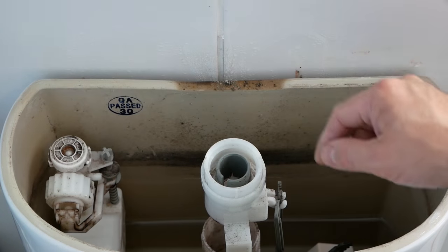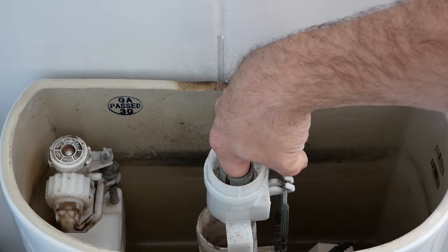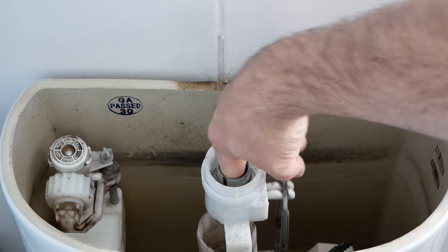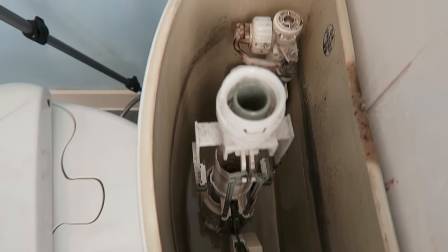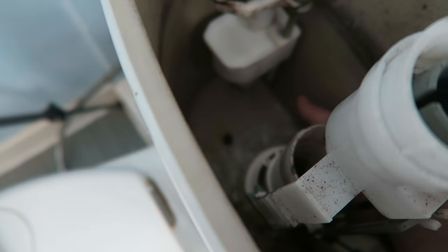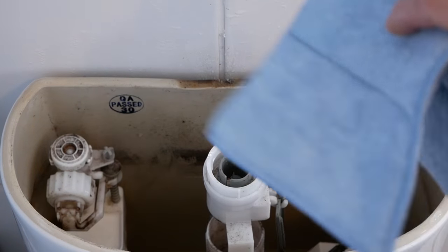You want to replace this part, but if you look inside there, it's still absolutely full of water. So you want to bail out as much water as possible. When you take this out, there will be a hole right in the bottom of the system, so when you unscrew that, any water is just going to run straight out of there. So you want to sponge out any spare water — I'm going to use an absorbent cloth. Just take your absorbent cloth and put it in there.